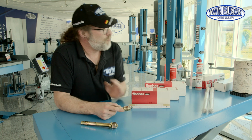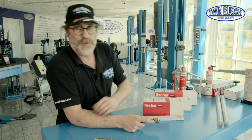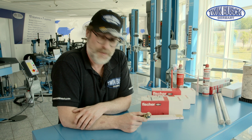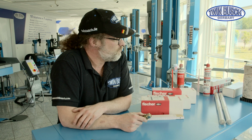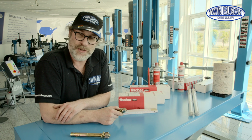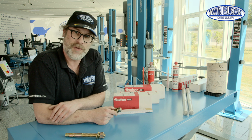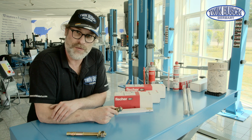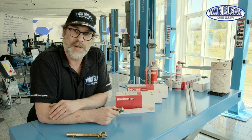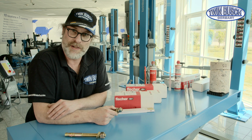For example, a 2-post lift with a lifting capacity of up to 4.2 tons requires a foundation thickness of 20 centimeters of concrete. Of course, it must be proofed if the garage or workshop has this or not. By making a test drill beforehand, we check how the concrete can be drilled. And we can get an approximate estimate of the concrete quality.